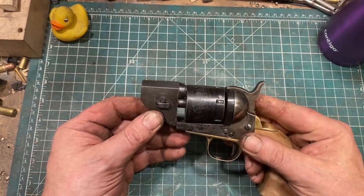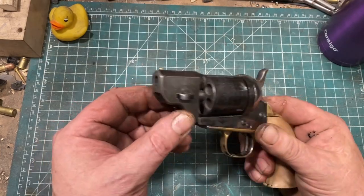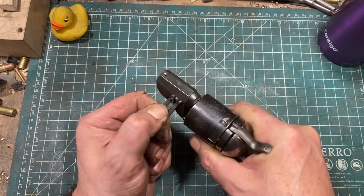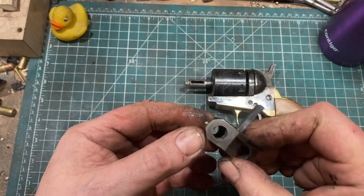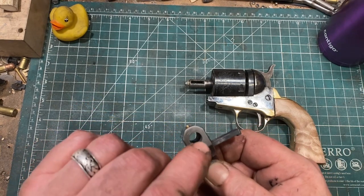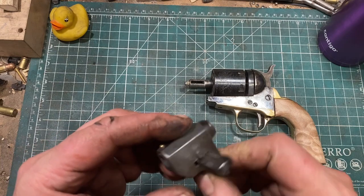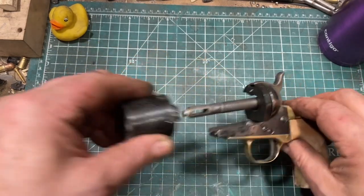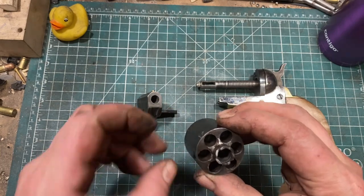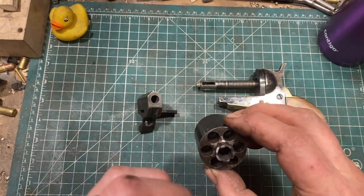The shape of this barrel is based on an actual antique that I found pictures of — it's quite stubby. Originally this was a .44 caliber barrel, and there was never actually a real .44 caliber Navy. So I lined it with a section of turned-down barrel from a .36 caliber revolver so I'd have a nice .375 inch bore. In typical fashion, I chucked up the cylinder in the lathe, turned it down, and then ran a reamer through it. There is no step inside these chambers for a cartridge lip because there is none — it's just bored straight through.